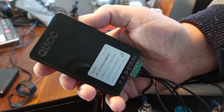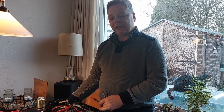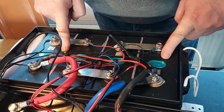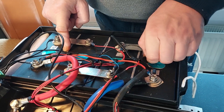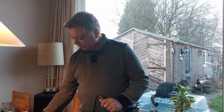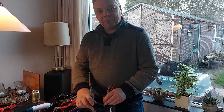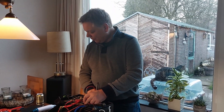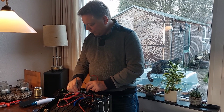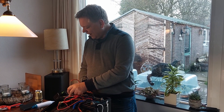It's called QUCC, which has reviews everywhere. I installed it. The differences decreased a little bit, but still it wasn't very good. I did not trust the connections between the cells and all the wires to the BMS, so I decided to double-check it with a simple multimeter. When I checked it, I found out that the difference between the cells was really non-existing. At the moment, the cells all reach the same voltage within the millivolt — it is now 3.328 volts — which is fine, and they all have the exact same value.